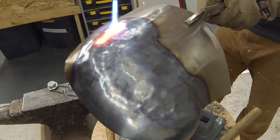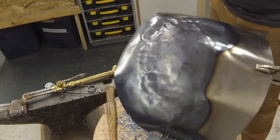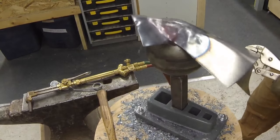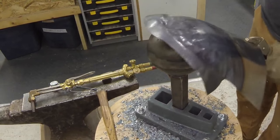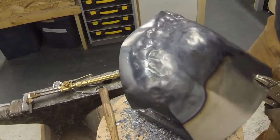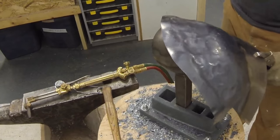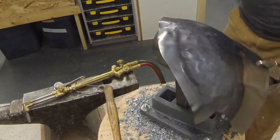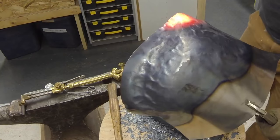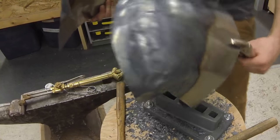When you're raising a helmet like this, I like to start at the ear and work my way up and around to the top of the head, front and back, in successive passes. With each pass you can push the metal a little bit further down. What you're essentially doing is thickening up at the edges as you move up the helm. The back of the head is always a little bit tricky — it requires a lot of squishing that metal together, so it required quite a few heats.